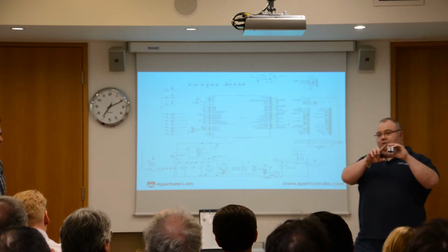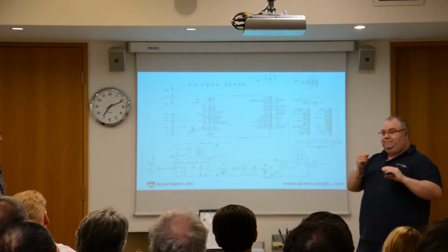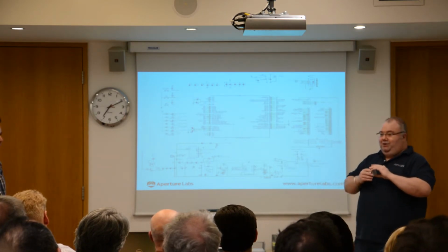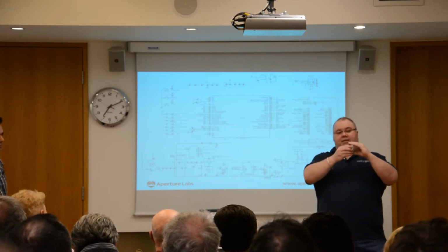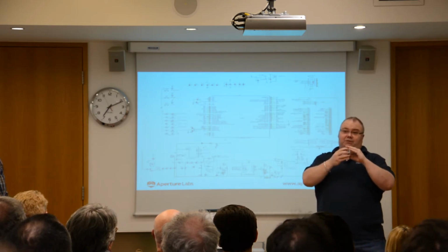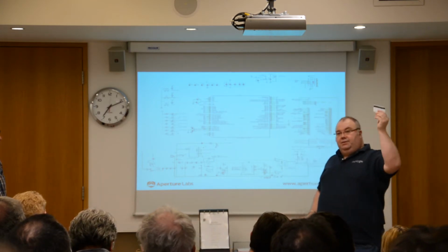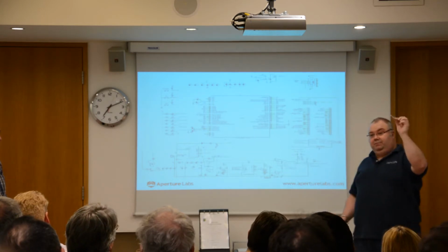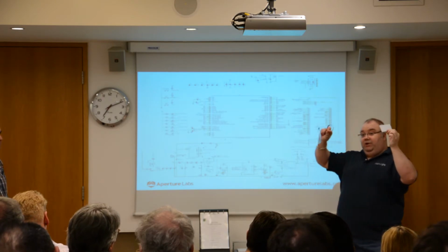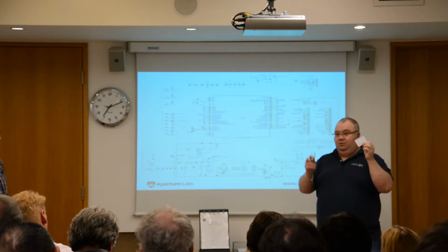In order for the card to signal back, what the card does is it shorts out its own coil. It's kind of like plugging its fingers in its ears or choking off its own air supply. But when it does that, it causes a very small voltage drop in the energizing coil, like 100 millivolts or something like that. And that's how it sends back a bit. So this card here, which is a 26-bit card, has 2 parity bits and 24 bits of data. In order to get that data across this air interface, it sends about 540 bits to get those 26 bits across.